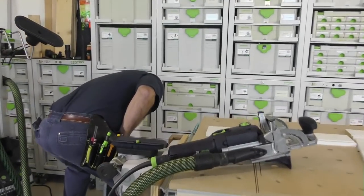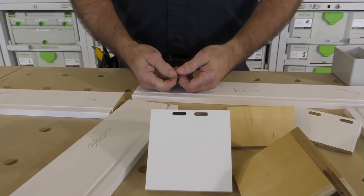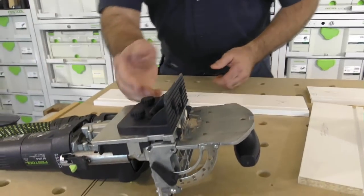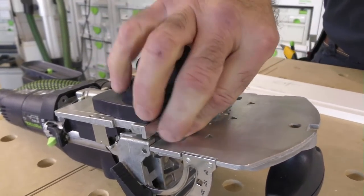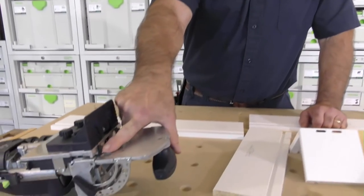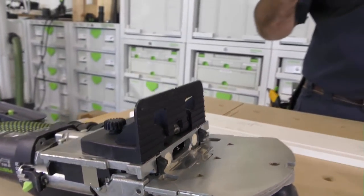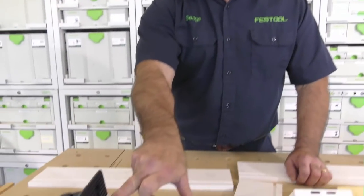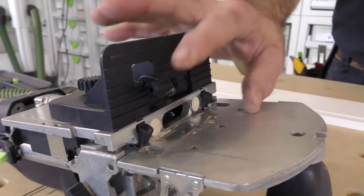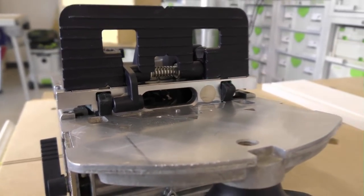I'm going to start labeling and mention a few things I ran into early on so you can see some hiccups to avoid. I also want to talk about this bracket and wing. See how that comes down? From the flap to the center of the bit is 37 millimeters — the same distance from the front of the cabinet to the center hole for hinge plates in 32-millimeter cabinetry. There's also a 20-millimeter offset to center, which I'll use for reference.